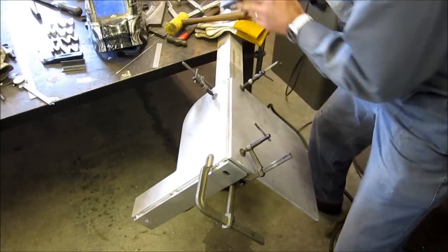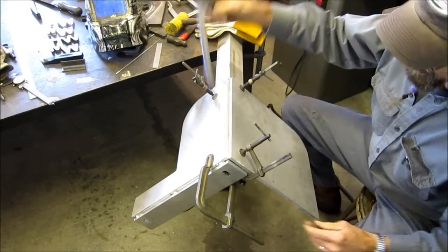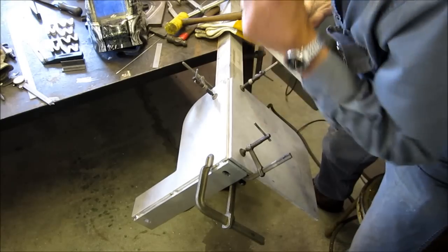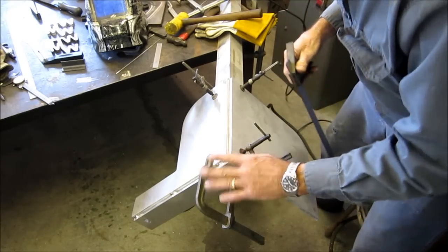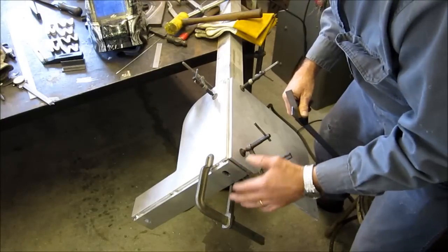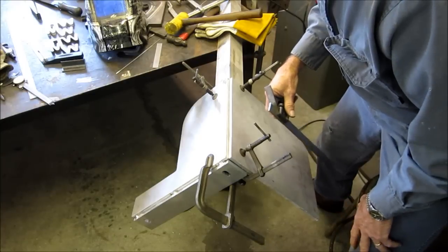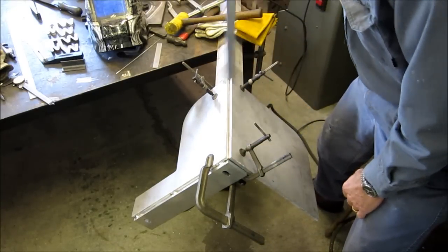Square there. We take a square here — that's good. All right, just a quick look. We're on the foot still, so this prior weld on the angle is still square. We're not going to tack it there yet, because when we get ready to add the other side we want the option to flex and maneuver. These tacks are pretty flexible in adjusting. Now we're going to put three along here and then be ready to start on the other side.